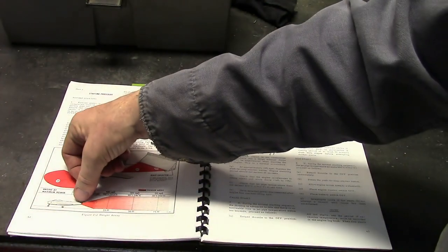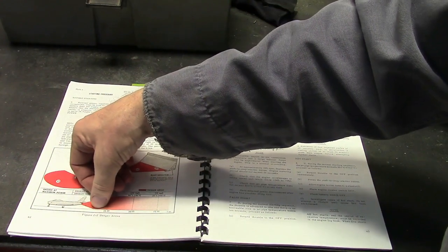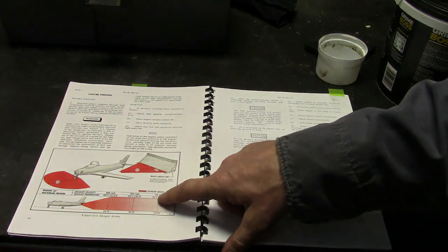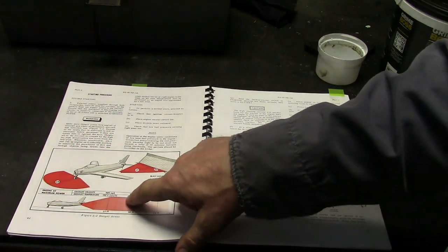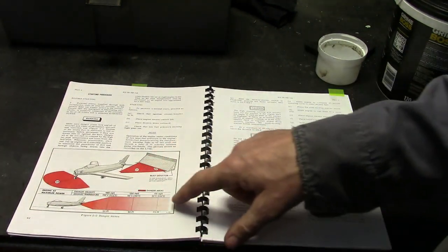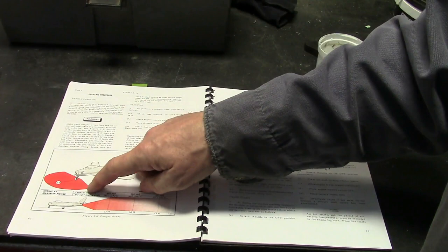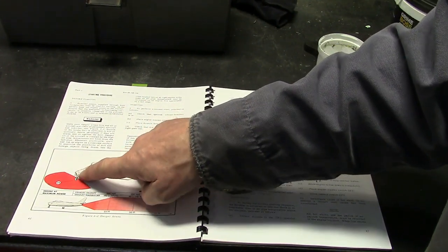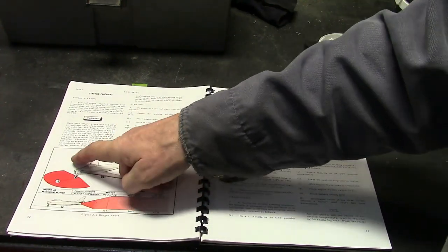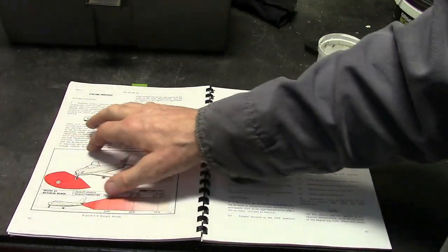You see how this hits the ground? The rocks and bits of debris that this jet picks up at 75 feet will almost be going the same speed as at 25 feet. The air is going 115 mph, but the rocks and sticks are going 400-something — and they're going to hurt. So don't do this. In the front it shows a 25-foot circle; there's less noise up there and probably less danger of being pulled in by the air pressure than from the test cell.